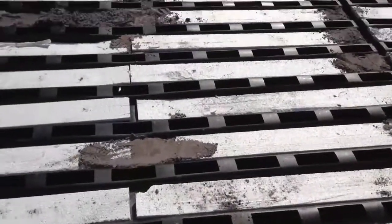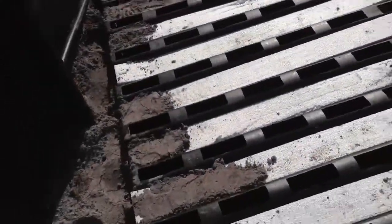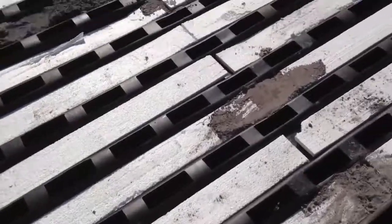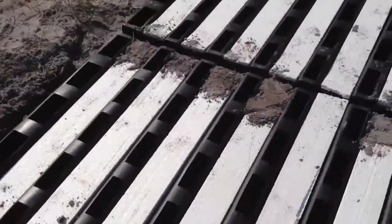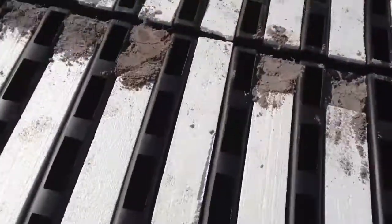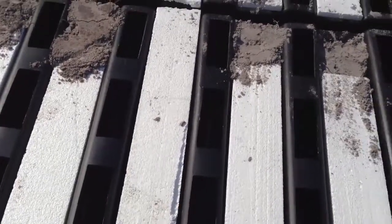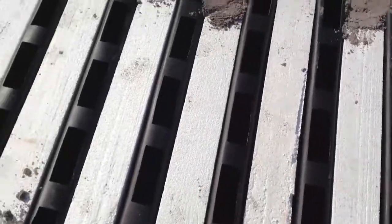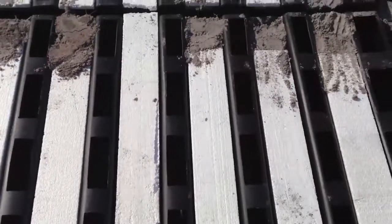This is ready to back up the truck to and pour. You can either pour with a pump machine, and you can walk on it if you want. If you pour with a pump machine, you just make sure it goes on these little beams. These foam tabs are just the gap areas. After we pour, we'll throw them away. If you don't use a pump machine, just pour the concrete on top.